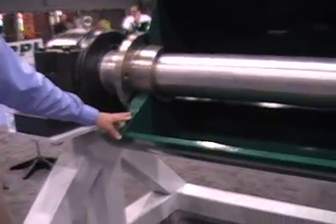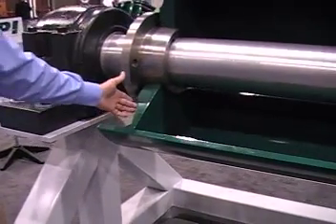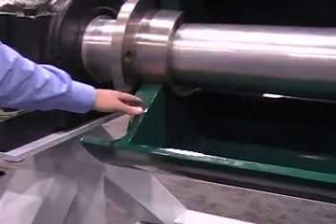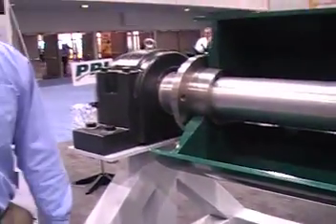What's unique about our Pro Series pulley is the profiled end disc. As you can see, it has a nice machined profile here. It gets rid of your hub welds that are your number one cause of failures in your pulleys. And we offer this at the same price as a conventionally built pulley, so we're very excited about this product.